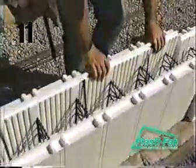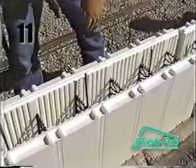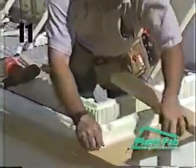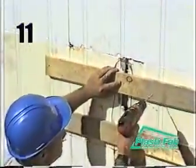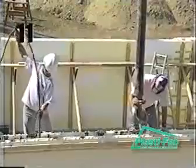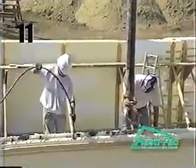Be sure that the blocks on the first course are set on the chalk lines. All T-corners and T-back bracing is in place. All rail ribbon is in place together with string lines attached, ready for wall alignment. You have extra pieces of plywood and bracing material at hand ready to deal with the unexpected.